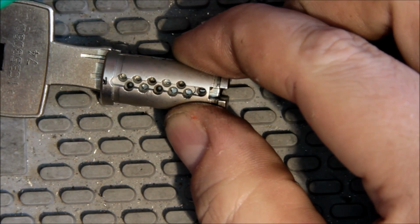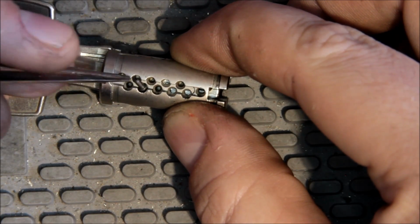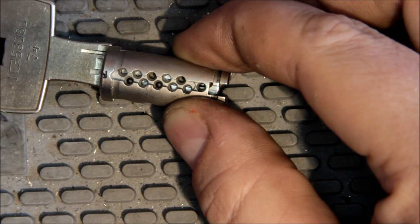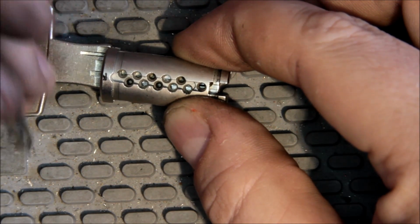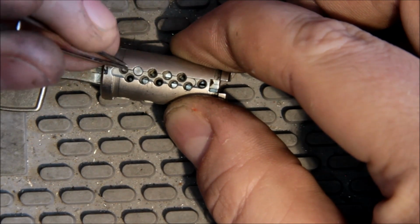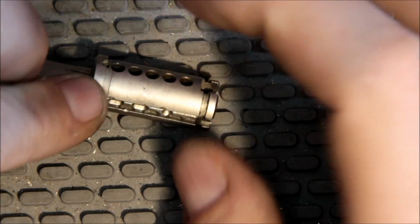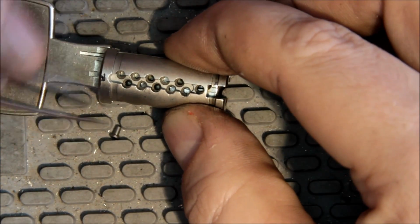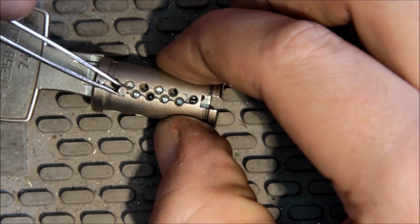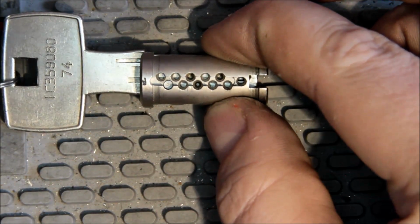So if I put one of these little T-pins in the wrong place, which is putting it anywhere is difficult, but the flat part of the T goes facing up. But if I put the T pin in a wrong hole, you'll see that he kind of sticks up just a bit, half a millimeter, maybe half the thickness of the top of the T. Okay, get out of there. If I put him in the correct location, and there are 4 of them on this key, and there are 4 T pins, profile pins, he goes down flush. You can see that pretty well.